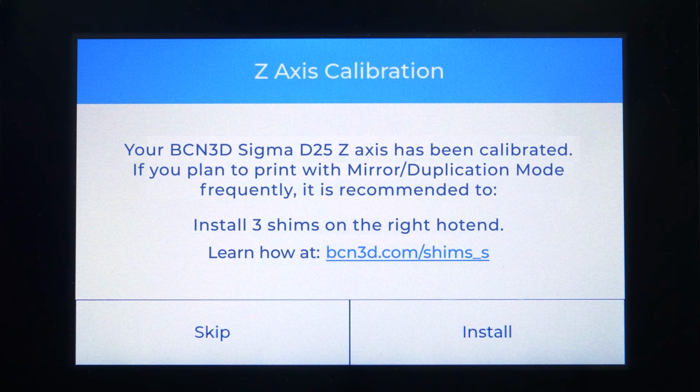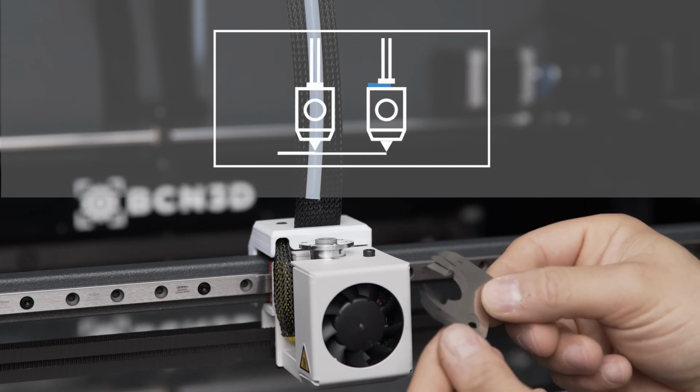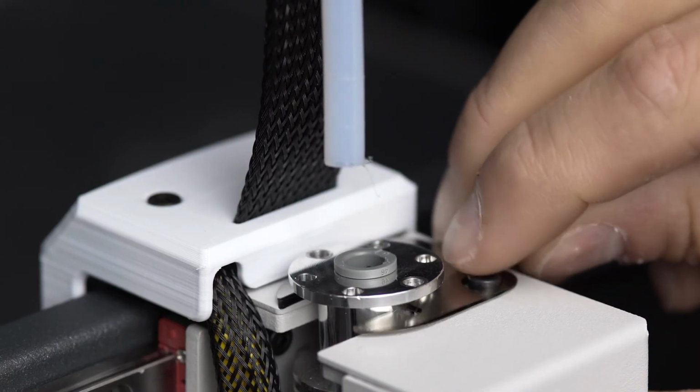It may be necessary to install shims on one of the hot ends in order to mechanically correct the offset between the nozzles. This allows the printer to accurately print in both duplication and mirror mode, which create 2 parts at the same time. To learn how to install shims, follow the link in the description.